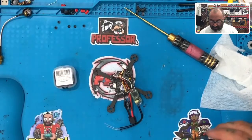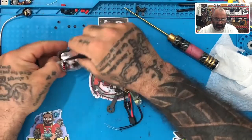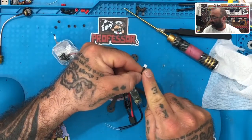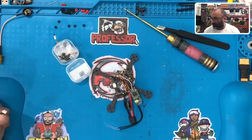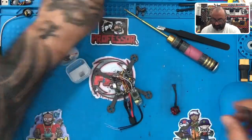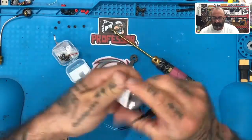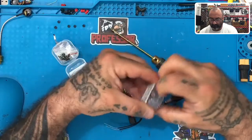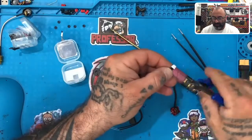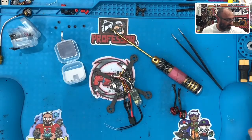So what we're going to do now is grab our motors and pop them open. These motors are pretty easy — all you're going to do is cut the motor wire right at the plug. You're not going to try to measure this, just cut it. Do all four motors the same way. Cut the white plug off and throw that out — you will not be using it again.